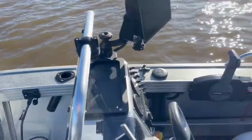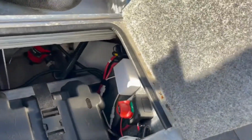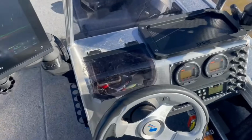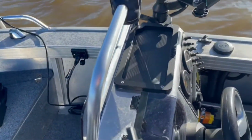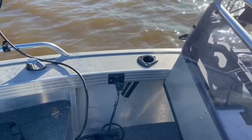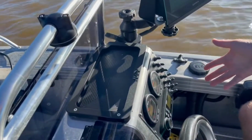We started down the back, so we've got her ignition, crank battery, new isolation switch and breaker for the accessory circuit. So we've done a whole new feed to the front to distribution posts up underneath the console that you see there. We've rewired all of the existing bilge pump, nav lights, anchor lights, undergunnel lights. Yes, they're her favourite disco changing colour style lights. All of the sounders wired back to the switch panel. We've integrated the Fusion stereo.